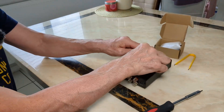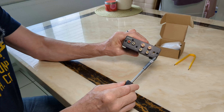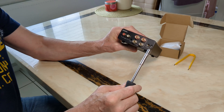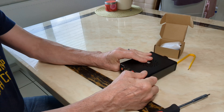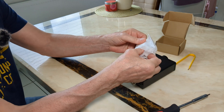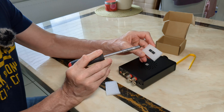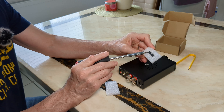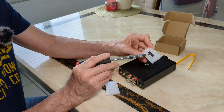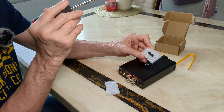Let's get these op-amps out. They're at the front here. You've got to remove that screw there - it's got a little Allen key, not a Pozidrive or Phillips. And you've got to remove that one there as well. Now, you've got to remember to put them in the right way. They've got these little cutouts and a little indentation. You've got to make sure they're the right way, otherwise you're going to damage your amp. So make sure you put them back in the right way using those little indentations and markings.